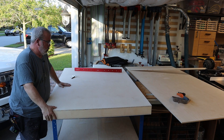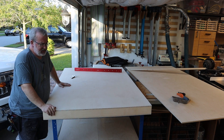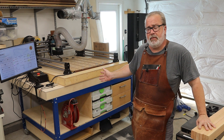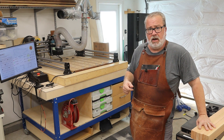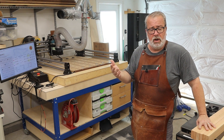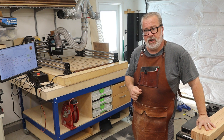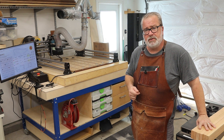Five to six thousandths — it's a great way to have a workbench top when you need it to be super rigid. This is all made out of half-inch Baltic birch because it's very dense and a higher quality plywood product. I hope you found this helpful and realize that this CNC application is not the only way a torsion box is useful — assembly tables, workbenches, and CNC platforms are all great examples of how you might employ a torsion box to take your woodworking or shop work to the next level. Please hit the subscribe button and leave me a comment — tell me about the last time you used a torsion box in your shop, or drop any questions below. I'd be happy to respond. Thank you again and have a great day.